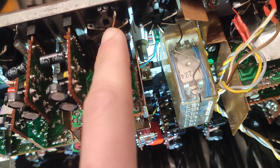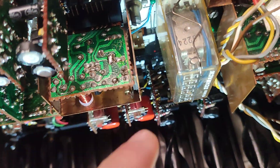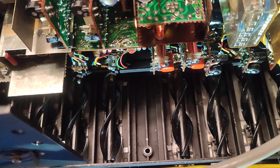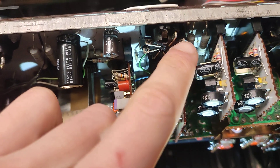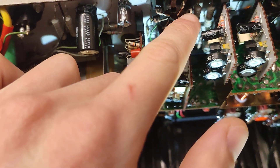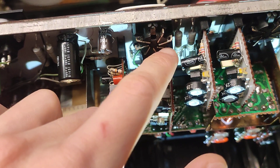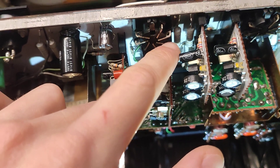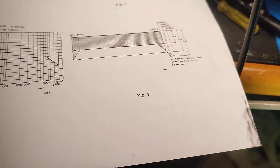It was such a small signal that I couldn't read it. So I used the before-after tape switch and adjusted the before-tape part and the recording part to have the same level on the monitor — about 1V. I went back and forth several times to get both channels reading the same level.